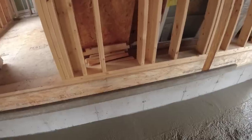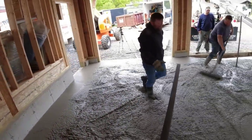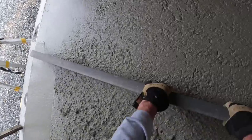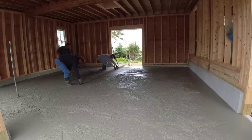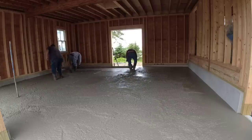And then the wire mesh and the slab bolsters, for me to go pick it up, bring it down here, lay it down, is $1 a square foot. The concrete itself, at 4 inches thick, these square foot prices are based on 4-inch thick concrete. So for a 3,500 pound mix, fiber mesh, the water reducer, I figure that at $2 a square foot. And then my labor to come down here and pour, finish, and saw this, because that's another day, and basically we just leave one guy here to finish it and saw it, is $3 a square foot to pour, finish, and saw.